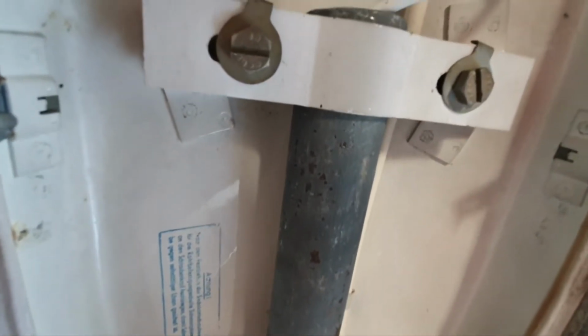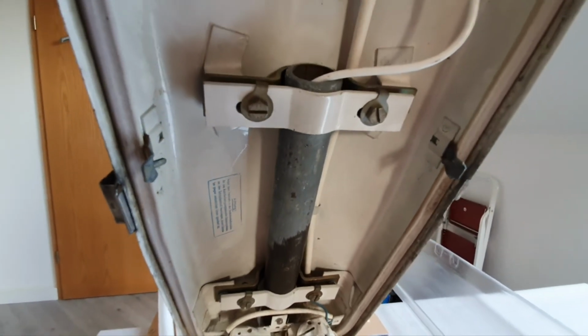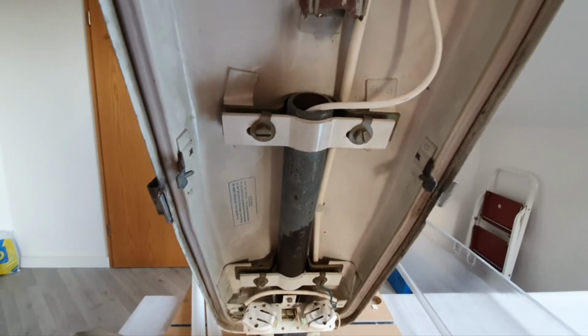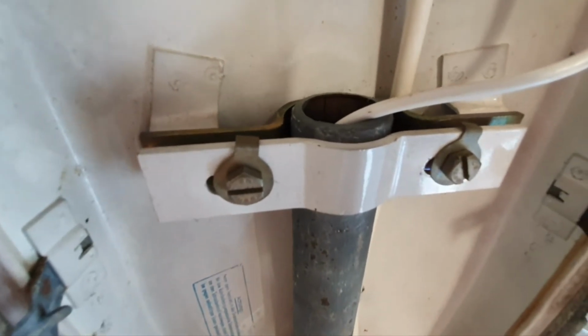And here on the down portion you can see that the fixture is mounted with these two straps that mount to the mast arm, and that's basically it. You have to tighten these 4 screws, and here is an instruction how to do that, and it says actually to bend up these here after you install the fixture so that it can't wiggle itself loose, but nobody has done it here and it hasn't fallen off the mast, so well, the manufacturer recommends that here actually.